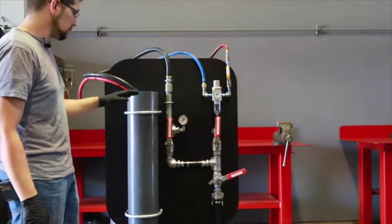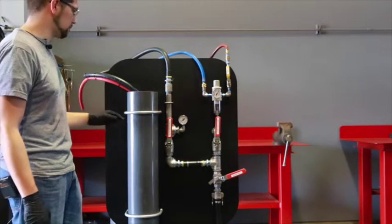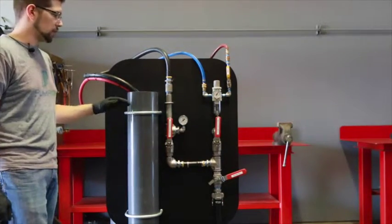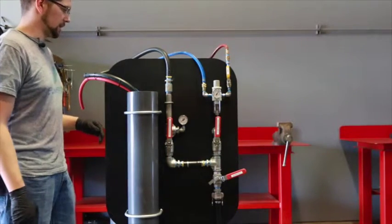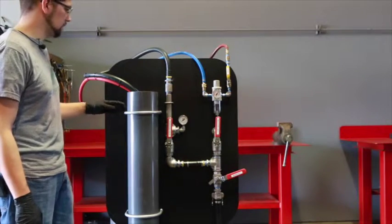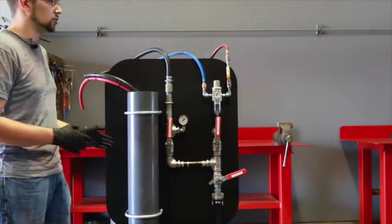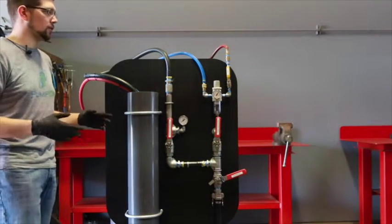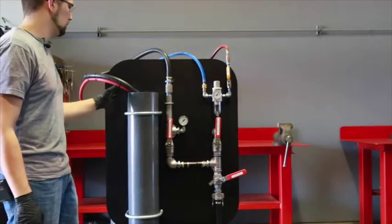So one thing we can look for is if we've stood here for a minute or two and it hasn't pumped, we look inside our vat and see that our water level has come up above our head. We know it's stalled, and we need to take it back down and find out what our problem is. But we'll let that pump once or twice, and like I said, anywhere from 20 seconds to 40 seconds, or even if you cut it down to a trickle, it's not going to matter. You're still simulating that slow fill of the well.